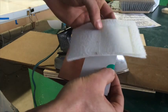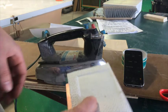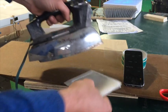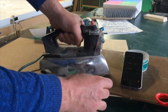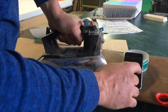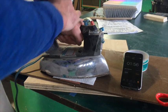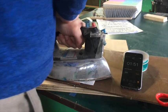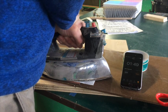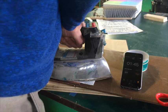I like to put a little piece of tape on there to get it in place and wrap it around so it holds on the board. I like to put a paper towel down over it - it just helps distribute the pressure. Put it where the iron was where it's nice and hot, and then you want to start your timer - two minutes works out pretty good for me. You want a lot of downward pressure, so hold it down there for a good 30 seconds to a minute to start without really moving the iron.